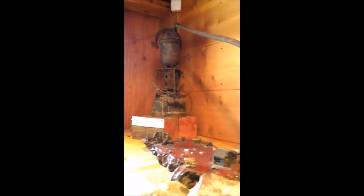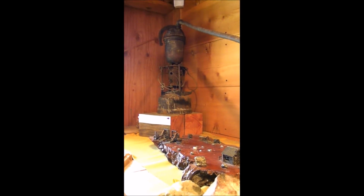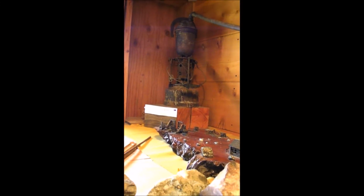This little thing right here. They put the gold ball down inside that little pot, and they put the lid on this thing, and the lid has a vent pipe attached to it, and it also has a locking ring, sort of like a horseshoe, and they put that locking ring on there very, very tight. They're going to heat this thing up, heat up the mercury, and if any of the mercury vapor gets out of this apparatus and you breathe it, you would get a disease called Mad Hatter's disease.